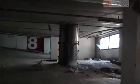We're now on level 8. This is where this main column has been jacketed. As you can see there's a large amount of floor displacement. There's a major flexural crack at the floor running along the beam line. This is level 8, grid E — the damage is very similar. Same rotational damage to the joint; it must be positive moment flexural cracking, about 1,500 to 1,800 millimetres out from the joint.